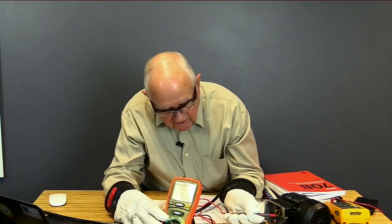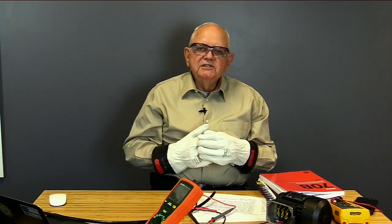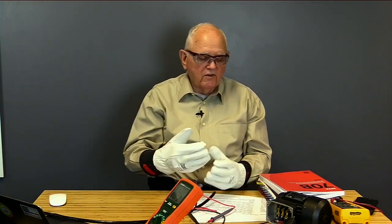One thing you have to keep in mind on safety on these is discharge. And so make sure we're back to 0 volts. The meter's been inspected before use, so I'm at 0 volts. Little motors like this, short runs of wire, will discharge themselves very quickly. Not true for larger motors, transformers with lots of windings, long cable runs; they will stay charged for quite a while. The general rule of thumb is that we discharge a circuit for twice as long as we applied the charging current to it in order to fully discharge it. Then, of course, we verify it with our meter.